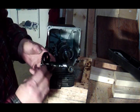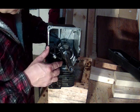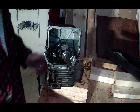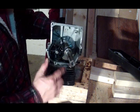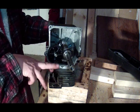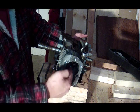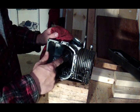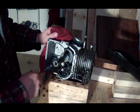These bumps actually press on the tappets, and as this spins around that is what pushes the valves open at the correct moment. There's a small dot on this gear and a mark on this gear to tell you how to line them up so that the timing is correct — make sure those two marks match. As the engine spins, the crankshaft turns the camshaft; the camshaft pushes the tappets up and down when they're supposed to be, and the valves open and close when they're supposed to. There's not much that can knock the timing off except maybe the flywheel key — if that's damaged, the timing will be off and your engine won't run right.